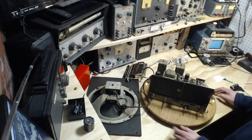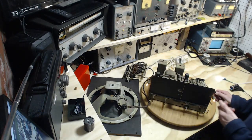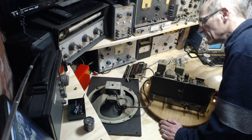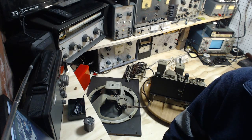I thought I got a whiff of old radio cooking. Yeah, it could easily be these lights with some dust on them. Doesn't quite smell like smoke. Now that output tube just does not appear to be outputting. Lots of heat coming off the rectifier tube there.